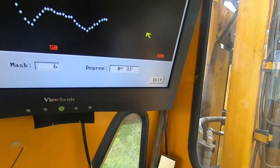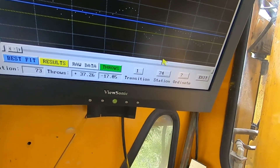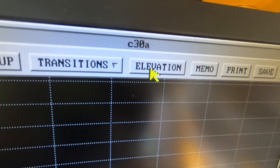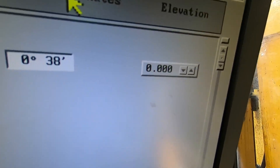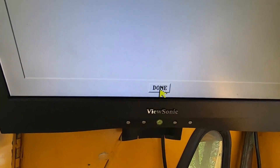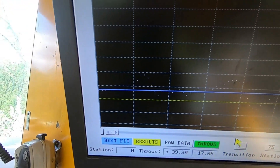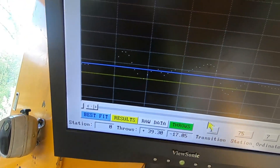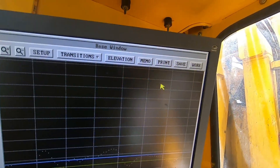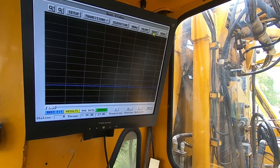Let's exit out of that — that's how the computer solved that, that's the fit. We have to go up here to enter our super elevation. This is tangent track so we don't want any super elevation in it — we've got zero zero zero, so that's good, no super elevation. I can move this any way I want with my computer keys. I'm going to save that for the first pass — curve file saved. Time to go back and line some track.